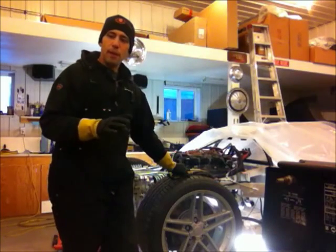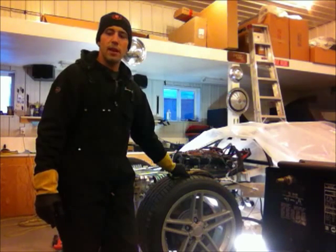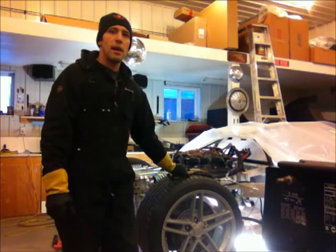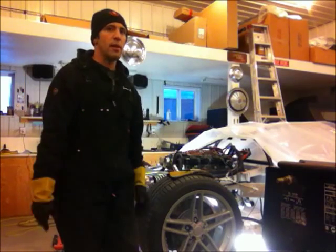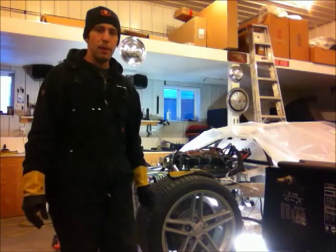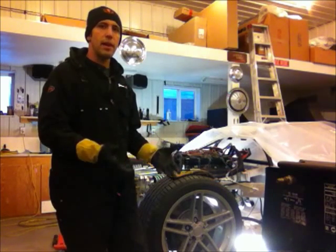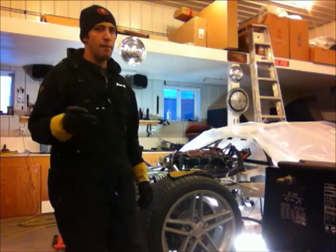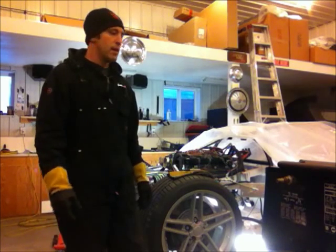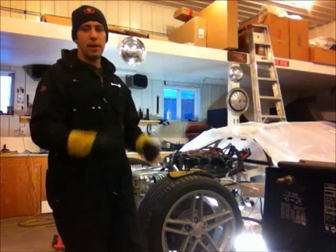As a side note, in order to take our original mock-up out of the car, some of the studs off the flange had to be removed, and we wound up actually taking off both sides of the headers. That's really the only way to get the exhaust. It has to come up out of the car. You can't drop it down, so be prepared to pull the headers. Same way going in, you're going to have to get the header, the flange, everything all under there, get it together, and then bolt the header in, and then finish your work on the flange. Maybe remove some of the studs, but I would start with 2 studs in the flange, just enough to get everything in place, and then you can put everything back together after.